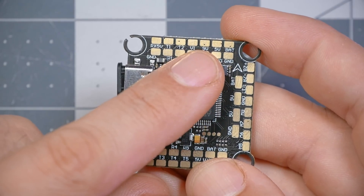We've got a 9-volt and a 5-volt regulator on board, and they are both big honking regulators. I think they're rated for at least 2.5 amps, and actual capability is higher than that, but we try to be conservative about ratings so you can really trust it. Pretty much anything you want to run off of here — including a powerful video transmitter — you'll be fine. The only place you could get into trouble is if you try to run LEDs; three or four LEDs will be okay, but 25 LEDs would need a dedicated regulator.